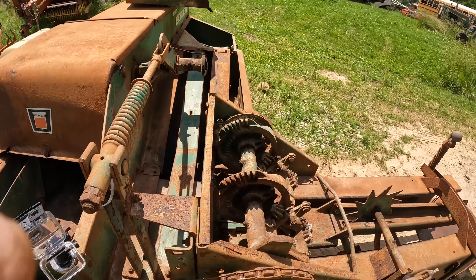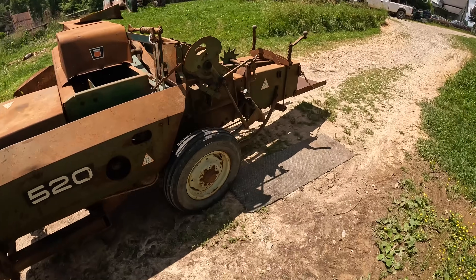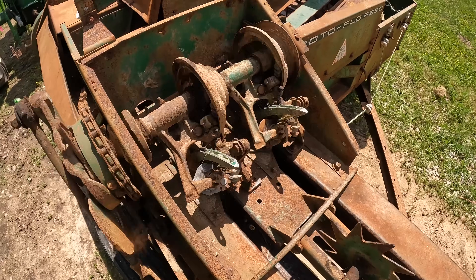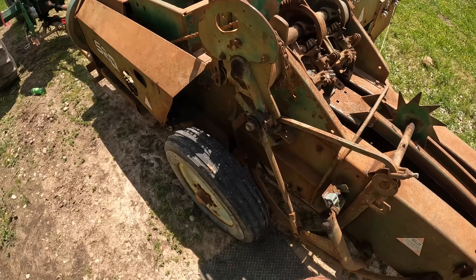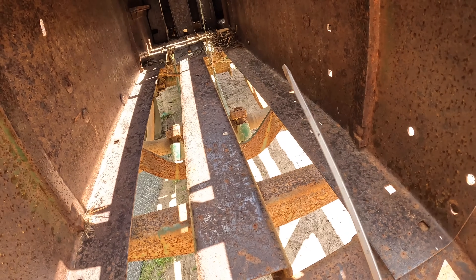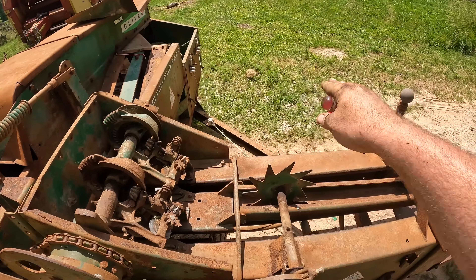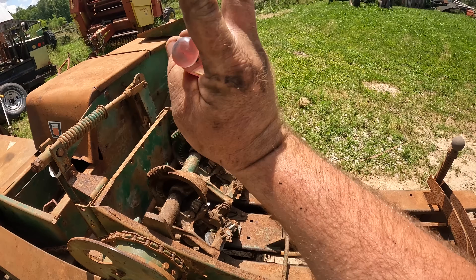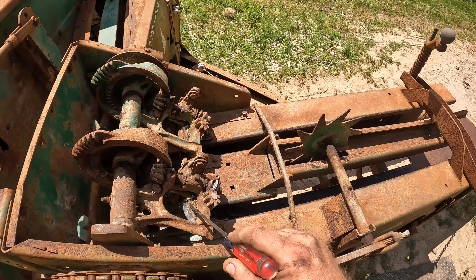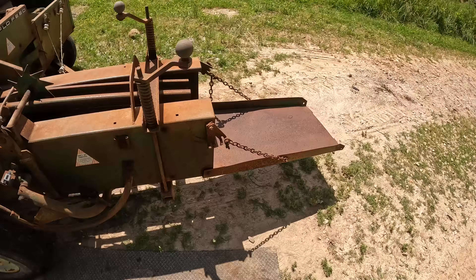We should be ready to start it up and trip this, and it's going to catch the twine in these twine discs so that it's ready to make a bale. This is going to happen fast but you'll see the needles come up here and put the twine in. Now it's ready to go. I'll be curious to see how long that lasts. You can see how our string is waiting, and then as it fills with hay it'll push against there — that will be the back side. Then when you're done the needles will come up and tie a knot and pull down at the same time, and that bale is done. Then it leaves the string up here for the next bale to go again — and that's how it goes.